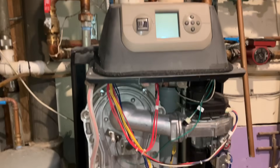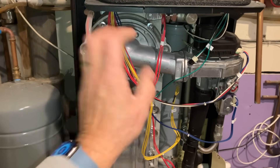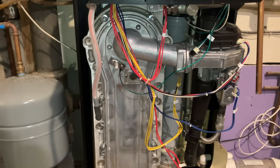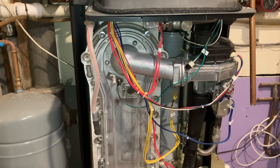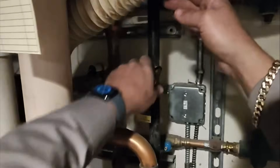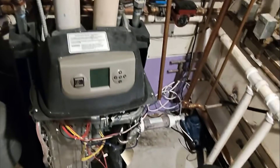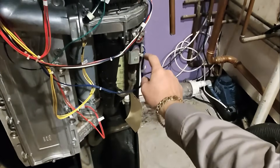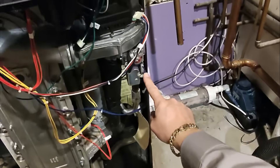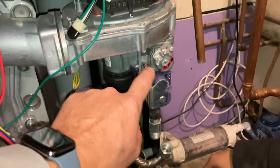That's it — we're here doing annual service. We're going to take this apart, clean it, put it back together, and it should take about an hour to an hour and a half. Let's go. Let's turn off the gas first. We're going to disconnect the gas flex going into the gas valve and then remove gas control wire, line voltage, and communication wire. All right, we've disconnected the gas, the wire going to the gas control valve, communication wire, and line voltage behind it.